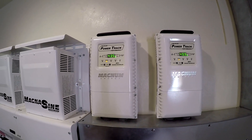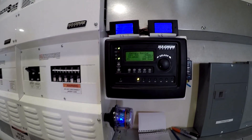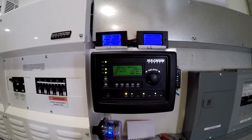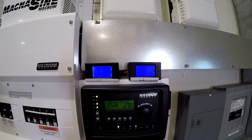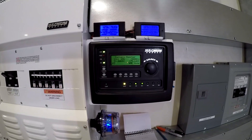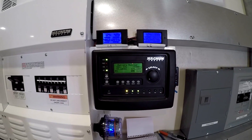So it's about 10 a.m. and I've got close to 100 amps coming off the panel on two chargers. We've got a net 76 amps going into the batteries and they've now charged up to 93 percent — that's doing good. We're pulling about 900 watts on base loads plus the pool pump. With this amount of power coming in I think we can increase how much we're using. Let's run some other stuff.